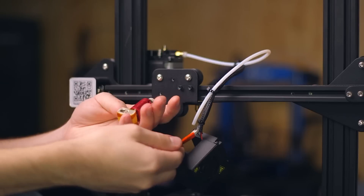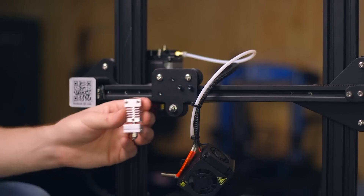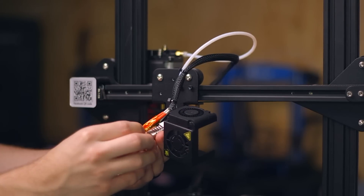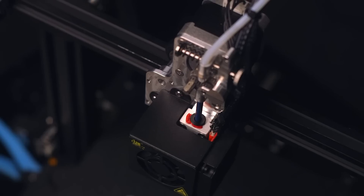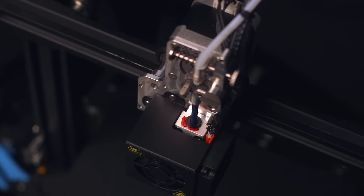Changing the hotend for your 3D printer is a quick way to unlock new, more advanced 3D printing filaments, usually by forgoing the PTFE lining and instead using a thin, all-metal heat break which allows for temperatures as high as 300 degrees Celsius. For Creality 3D printers, you can usually find a Micro Swiss hotend in the right form factor for a drop-in replacement that doesn't require any modification to your 3D printer in the form of soldering or printing out new mounts.